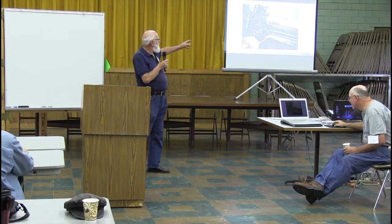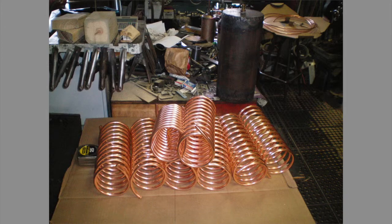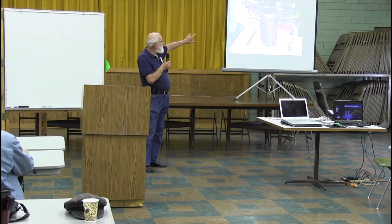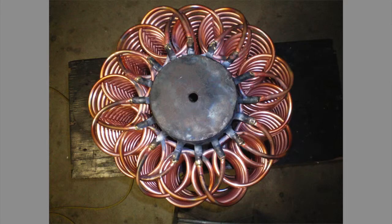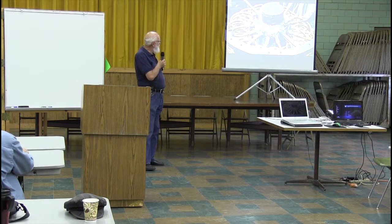I started using copper. I like copper — it's easy to work with. I set up a mandrel and marked off on the lathe, and I'm just winding it, and there's my coils. I got right hands and left hands, so they mesh. There's my center drum. I use a six-inch this time instead of a half-inch, and those are quarter-inch black iron pipes coming out so I could braze it. To me it was looking pretty purdy, but once it gets soot on there, it looks like black iron pipe.